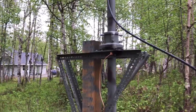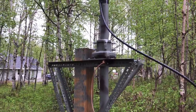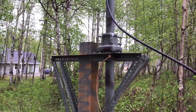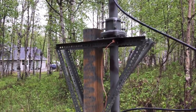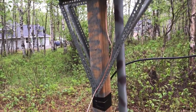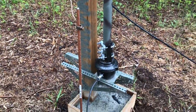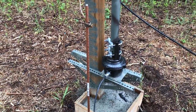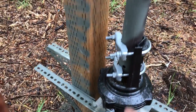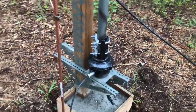Most of the weight of the mast is taken by this thrust bearing, which is the large Yaesu one. Nearly all the weight is supported by that. The structure is very strong, all angled and dangled, so the turning forces on the rotator are very minimal. The rotator isn't taking any vertical weight — in fact there's actual space between the bottom and the mast. If you clamp this off, you can actually rotate the mast by hand. It takes the stresses off the rotator.